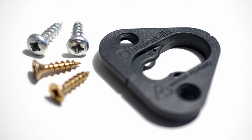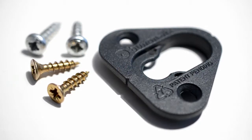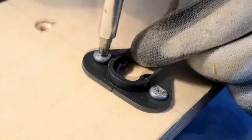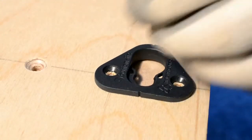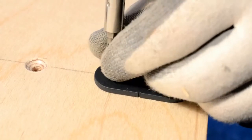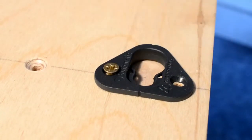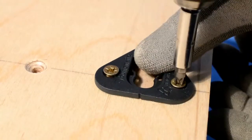We are using the Type 1 ButtonFix, which is specifically designed for heavy duty applications. The fix can be surface mounted with a pair of 5mm pan head screws, leaving an 8mm gap behind the panel. Alternatively, if space is critical or if you want to maximise the strength of the fixing, the fix can be rebated. Use 4.5mm countersunk screws to ensure the screw heads don't project.